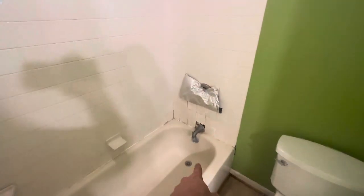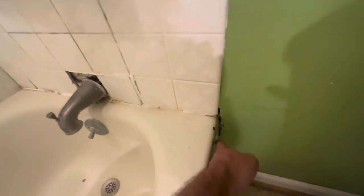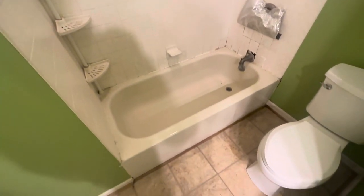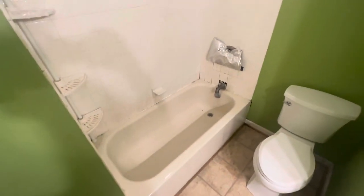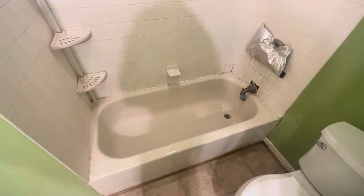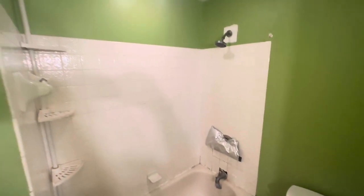At some point unfortunately someone slipped and fell and landed on the nozzle here - you can see it's just loose and there's some damage there. What we're going to be doing is gutting from this corner all the way around to here, tiling the whole area with the same transition-less shower basin we did in the other one - just different tile, different design, same toilet. This thing is going to be a challenge though - this is an old metal tub and I'm not sure if it's steel or cast iron. You can crack cast iron open with a hammer, but if it's steel I'm going to have to cut it up with my grinder. Let's see what this is going to take.